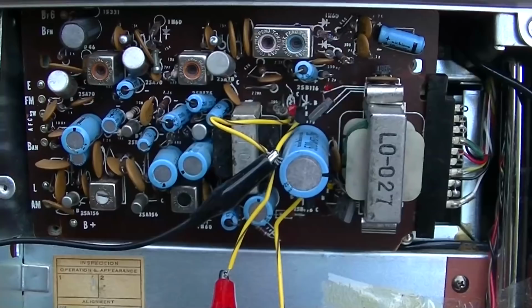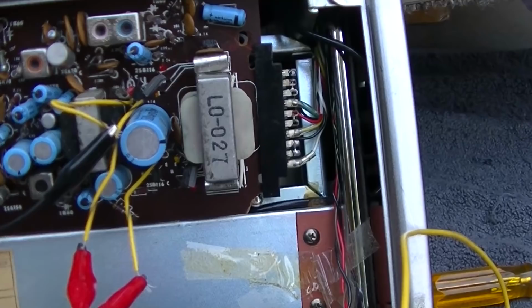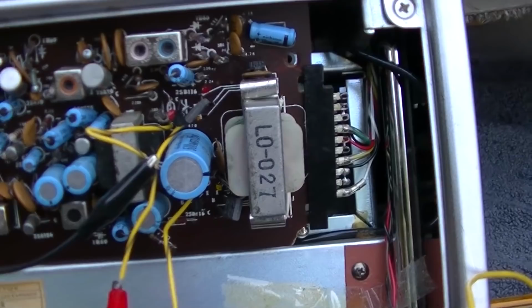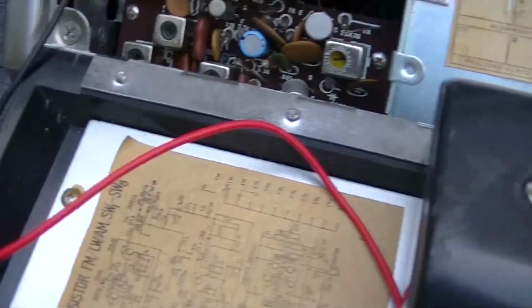Okay. Now I'm up at 1,000 ohms and it sounds better and my current is going down. So what I'm doing is I'm switching the resistors and then playing with the bias and listening for a difference. And I know I should be using a scope and whatever, but I'm going to just go this way. So I'm going to play around 1,000 and see what my best is. If I didn't have two of them, I'd be using pots.